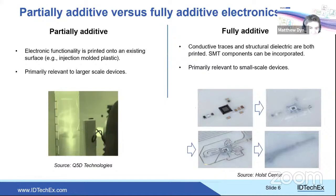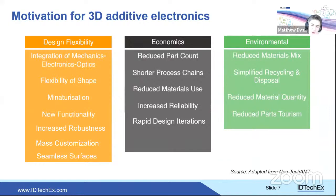Illustrating the two approaches: on the left, conductive inks are applied to the side of a plastic tube, enabling additive manufacturing advantages — reduced material use, digital manufacturing — on larger objects. On the right, fully additive printing builds the structure, conductive traces, and integrates components like resistors and an IC within a complete plastic structure, starting from nothing.